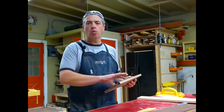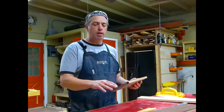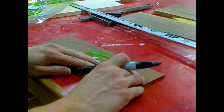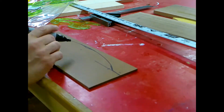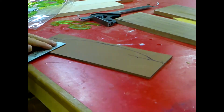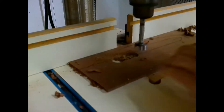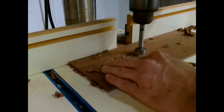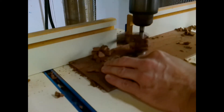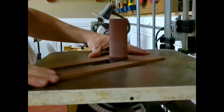I'm going to take a piece of hardboard and draw out a template to figure out how I want to do that, then take it over to the bandsaw. I used a French curve and a ruler, and I kept playing with the template until I came up with something visually pleasing. I used a Forstner bit on my drill press to remove most of the material, then took it to the oscillating spindle sander and cleaned it up.